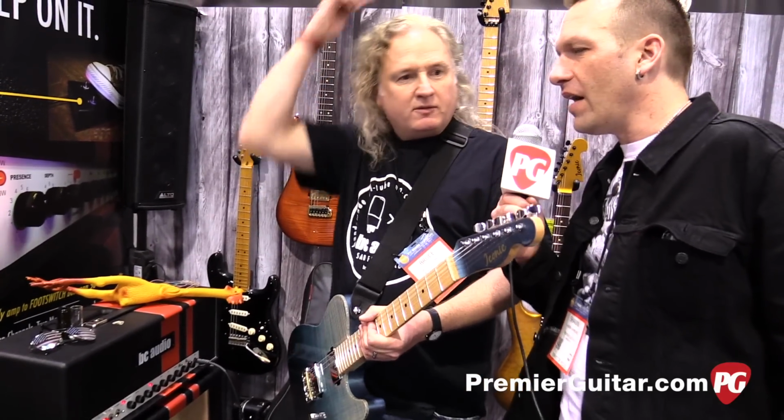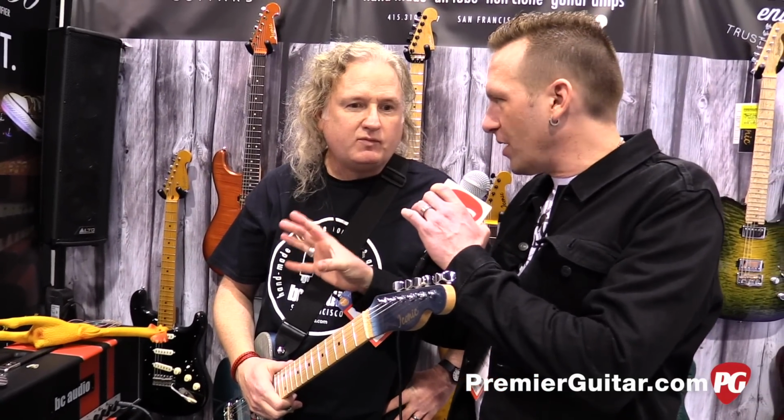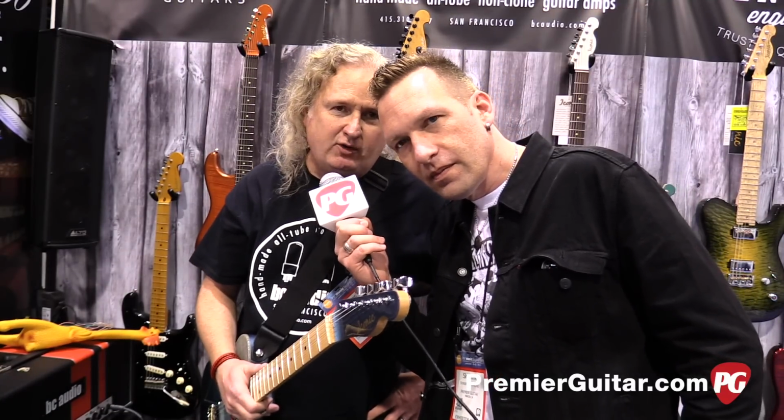Nice. Now, before I get to the hand wiring, are there any notable aspects on the back panel you want to talk about? Well, on the back panel, you've got a three-way impedance selector, 4, 8, or 16 ohm, typical kind of thing. Two speaker jacks, so you can plug in two cabinets, and then the effects loop, send and return. As I said, it doesn't have send level and return level, so you just plug in your pedals. It will work with studio gear if your gear will accept a lower level signal, but it's designed to work specifically with guitar level, pedal level stuff. Because most guys are using their amps that way anyway. They run a couple cables out to the pedal board, and you put your delay and reverb and stuff in the loop. It sounds better than out front of the amp usually.